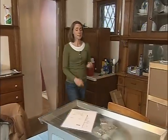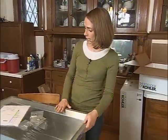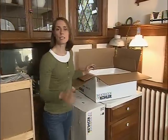You're ready for countertops, it's important to have your sinks picked out ahead of time so that the fabricators can make the proper cutouts. We're working with 2 sinks. One is stainless steel for the kitchen, and the other is for the powder room, and that's going to be a vitreous china sink. Both of these sinks are undermount, which means they'll be attached to the countertops from underneath. That'll leave the edges of the stone exposed, which will then get polished during fabrication.